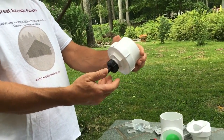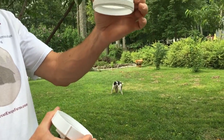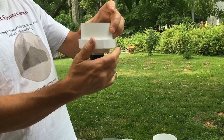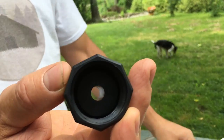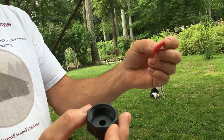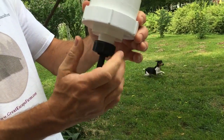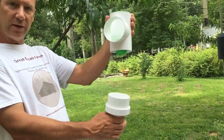At the bottom of the PVC is this assembly here — a couple of things going on. This piece right here actually glues onto the bottom of the three-inch PVC. You have your screw piece here with a little rubber o-ring inside — you've got to make sure that centers up and screws on. Then we have this piece on the bottom which connects up to a hose. For show purposes I'm going to use the larger gasket here, place it facing down so it's flat at the top, and screw that back on.